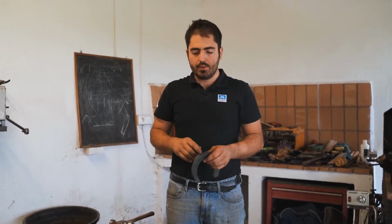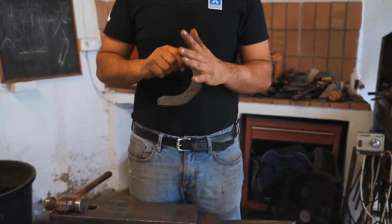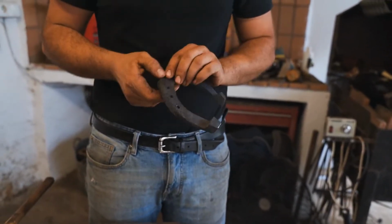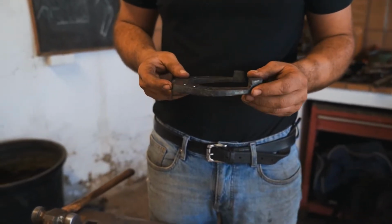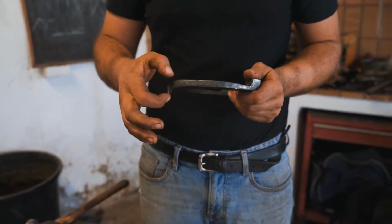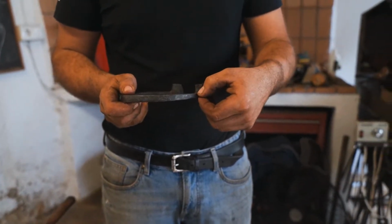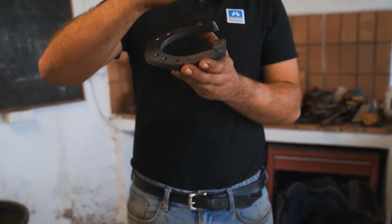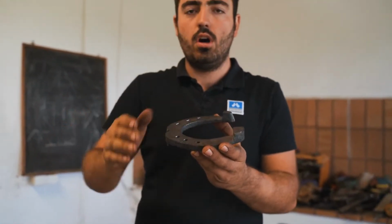It's also very important to get a strong clip on the toe to give some good support to the hoof wall. And in this shoe it's very important to get a good wedge section from the toe to the heel. So we start at 13 millimeters and we finish at 7 millimeters pretty much. So the heel is set down with an angle to the toe, it's not flat, it's angled to the toe.